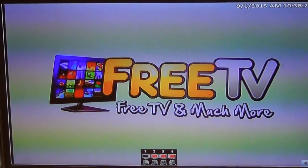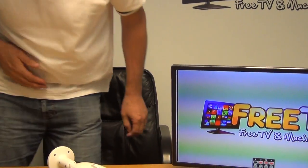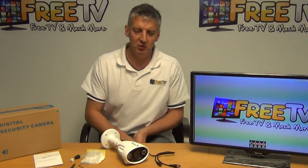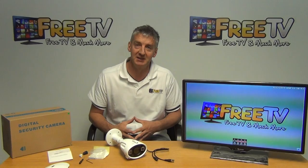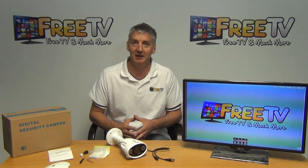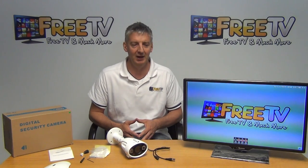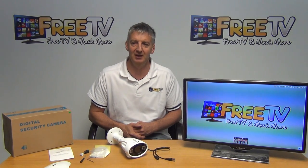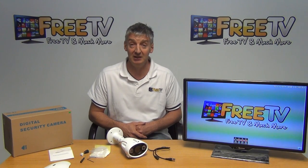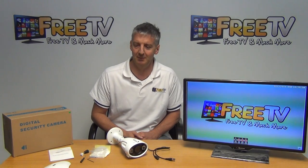This camera is part of a wider range of AHD cameras and DVRs we're stocking. We think there's going to be a huge market for AHD products because it uses the same skill sets, the same cabling and power units, and it allows you to upgrade systems in a modular format. For example, you could upgrade a single camera directly, or run an AHD DVR with an AHD camera covering a key area like a driveway, and lower resolution cameras covering other points.